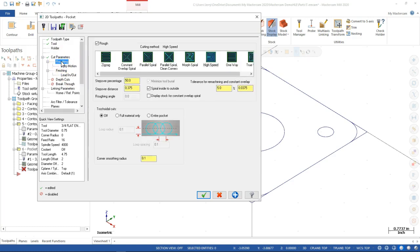All right, and then the other thing is the familiarity with the tools. If you've used that tool enough that you can say from the touch off, from the start, that I'm going to go into compensation and subtract out like 2.5 or 3 thousandths, then we're going to be right there in the ballpark anyway. All right, so let's stay with the spiral.